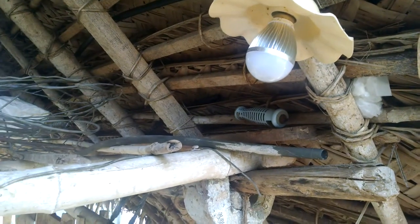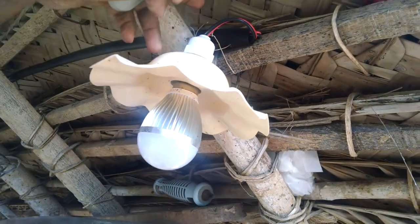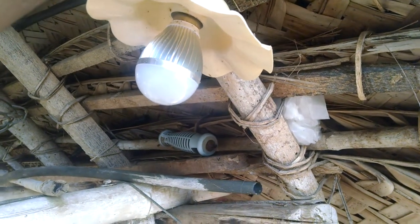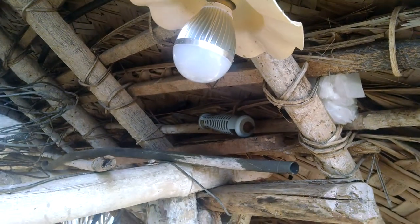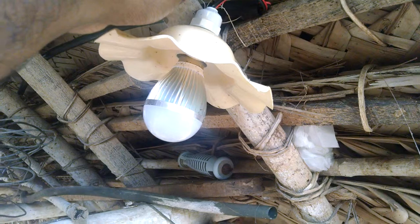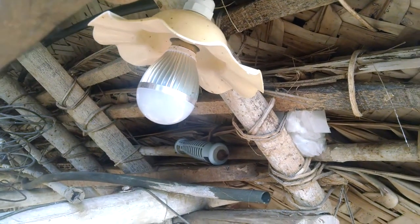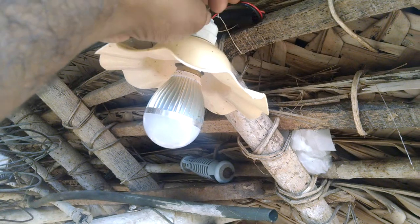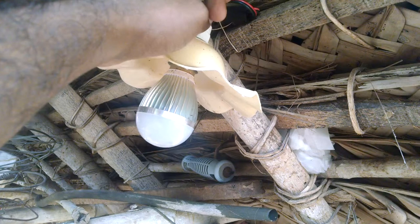I have used drip irrigation hoses to wire things up, along with some speaker wires that were lying around — good quality wires. When using DC, you should make sure you don't use wires that are too thin, because unlike AC, the implications of resistance on DC voltage are really high, which causes a lot of heat. Always use the right gauge wire for DC.